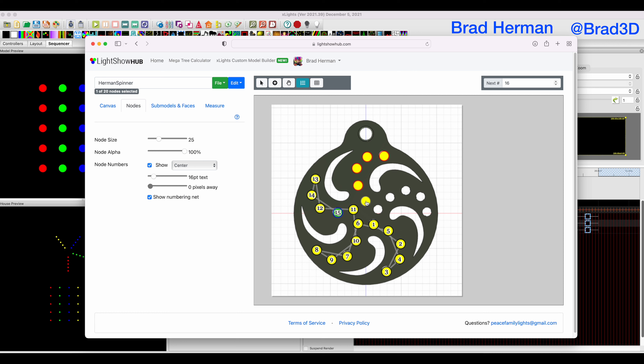We'll go back into numbering mode. We know we're going to jump from 15 over here to 16, then 17, then 18, 19, and then back to 20. Then from 20 we jump across to 21. Now technically you could have just ended on one arm back here, but what you always want to do when possible is have the identical pattern going all the way around. That makes our lives a lot easier when actually wiring — it's much easier to not make mistakes, which should always be the preference.